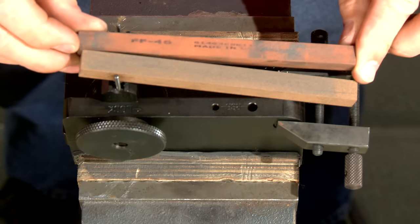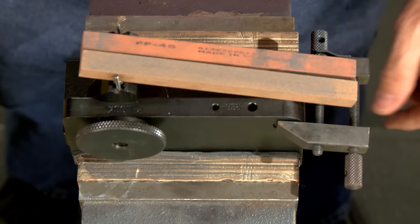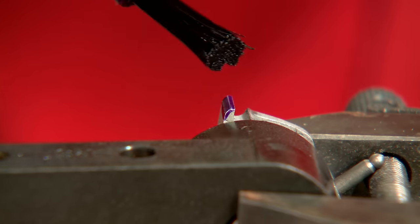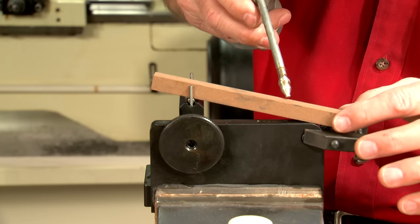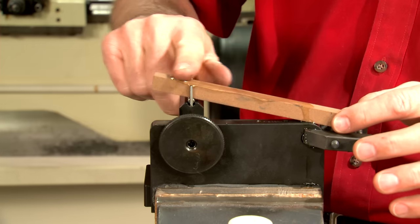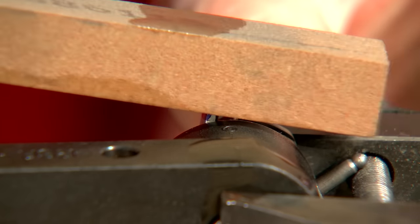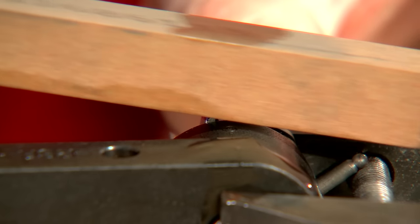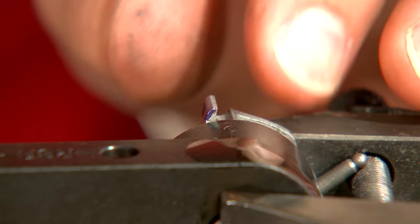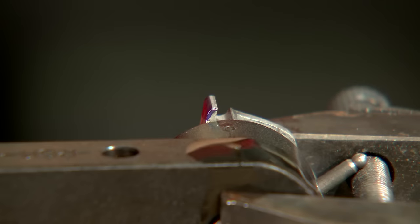The fixture is adjustable, allowing us to move the roller guide to change the weight of our trigger pull. I'll start with a medium India stone and finish with a fine. A bit of Dikem makes it easy to monitor my progress. Whenever using a polishing stone it's important to use plenty of honing oil. Now I carefully move the stone back and forth, frequently checking my work.